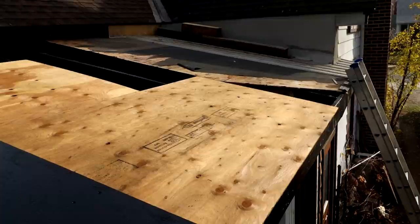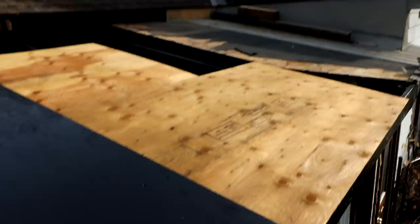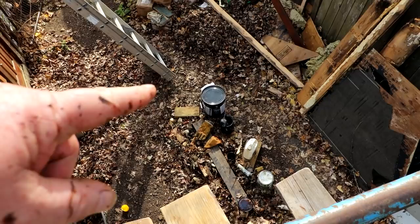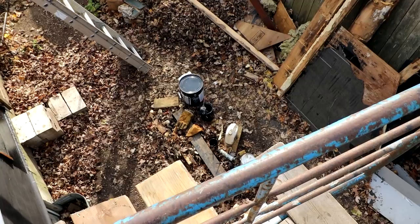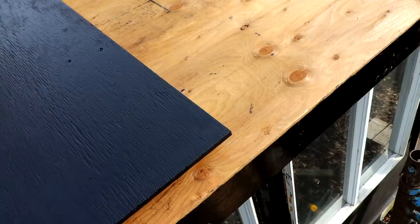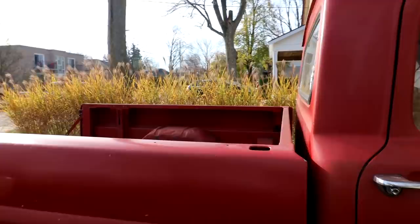I've got beautiful weather today - it's just fantastic. There's no bugs out, no leaves to fall on my tar since all the leaves are off the trees. If anything I'll be too hot - so that's good. I've got to mix up my tar - half tar and half mineral spirits, paint thinners. That makes a good mixture for painting on the roof. If it dries in the sun here, it'll be tacky dry in maybe an hour or two.